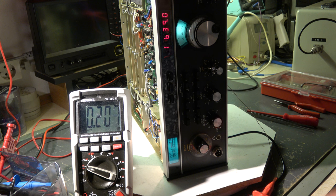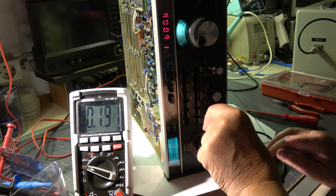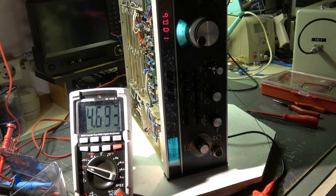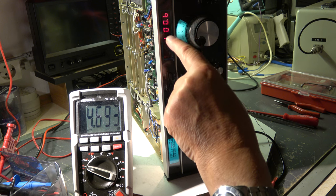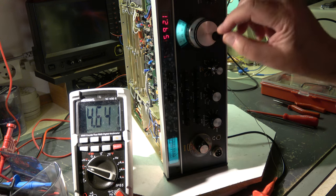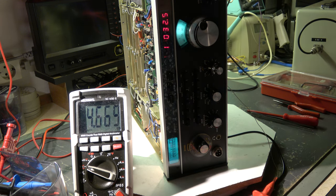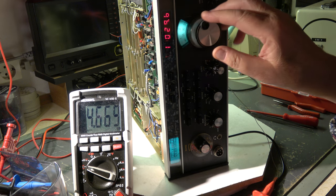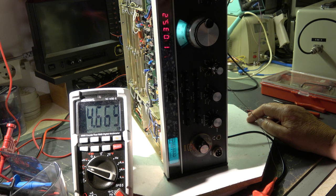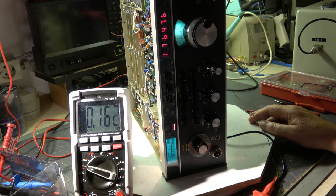When the auxiliary program is at zero we have 1.5 MHz and 1.6 MHz. When we go to the first auxiliary program — now the voltage appears at 4.6 V — the relay would be energized. The ranges are: 100 kHz down to zero, 500 kHz up, and 1 MHz up. So we have three bands programmed for longwave reception, and this actuates the relay to connect the longwave antenna. Programs 4 and higher are not equipped. I can remove these three diodes from the auxiliary program switch.